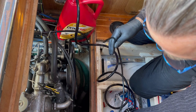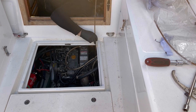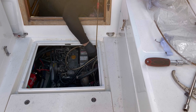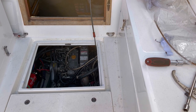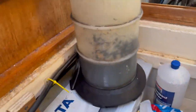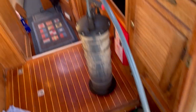I've got my manual pump with me, so I'll be able to carry on. I've been using these manual vacuum pumps for years and they really are easy to use — I don't know why I bothered with the electric one. I just thought it was a good idea at the right price when I seen it sitting on the shelf waving at me. There's definitely going to be some more oil left in there. So here it comes — I end up pulling another litre out, which is a lot that the electric pump couldn't get. After sucking the engine dry, I sucked the gearbox dry. I'm blessed with the same oil in the gearbox as the engine, so it's a job you may as well do at the same time.